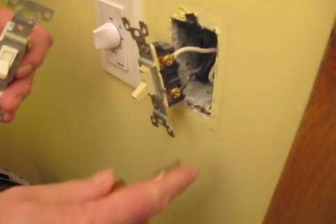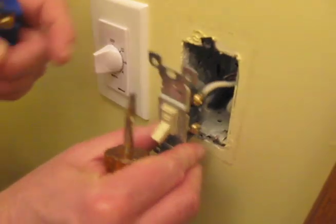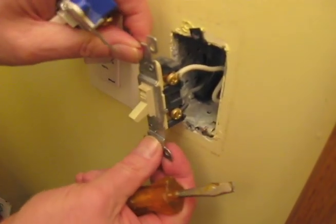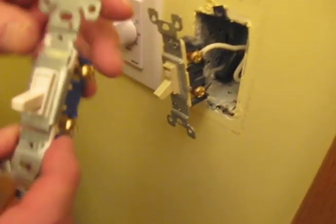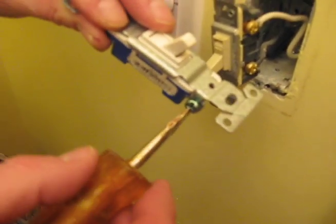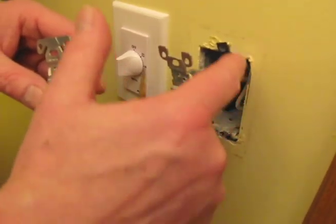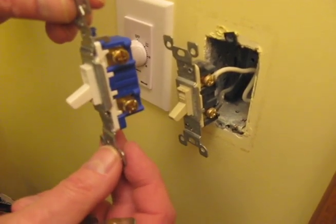You'll notice here a wire — this is the ground wire. It's attached to the metal box for grounding. This particular switch doesn't need a ground wire because the metal from the switch attaches to the metal box, so it is also grounded. This particular switch has a special green screw for a ground wire to connect to, and you want to use that if you have one of those blue plastic or some other type of plastic box that your switch mounts into.